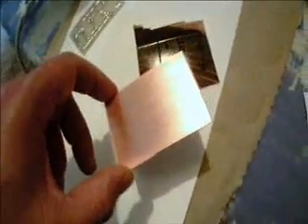So what I'm going to do now is pre-heat. I've cleaned this with a scouring pad — like a kitchen scouring pad — and I'm going to use a scouring pad and acetone to remove any oils or grease that would stop the toner sticking to the board and also prevent etching. So I'm going to place that onto there, iron it on, pre-heat that and then put that on, iron it on nice, and then soak it in water. Hopefully it will come away and leave a nice toner mark.